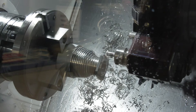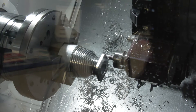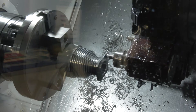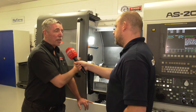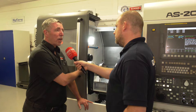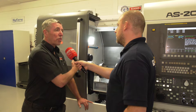Then about the concentricity or the turning element — if the collet chuck is put on correctly, you maintain your concentricity and accuracy from there. The whole thing is you haven't got to start zeroing the chuck in, because it already follows the taper of the chuck. The collet chuck stays on the machine, zeroed to more or less nothing, and then the 3-jaw chuck follows that.